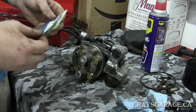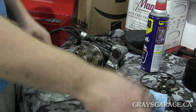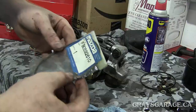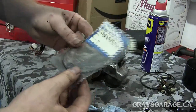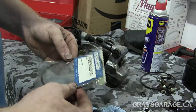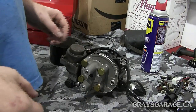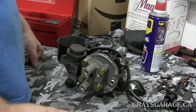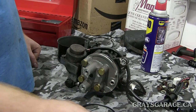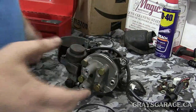We've got our new kit here and we can put the new o-rings back in. Technically you're supposed to pre-oil these. I'm going to go clean the rest of the pump interior first, and then I'll add some grease to these just to help seal — just some regular automotive grease. Everything's cleaned up now — the final step is to put the new o-rings in with a little bit of grease to help with the seal and keep them in place while reassembling, and then put everything back the way we took it apart.